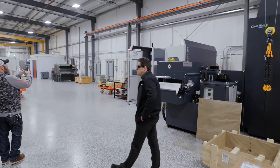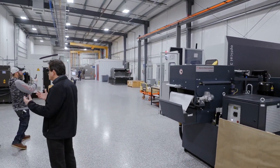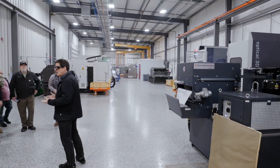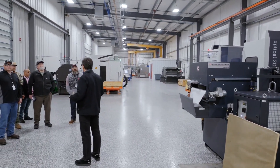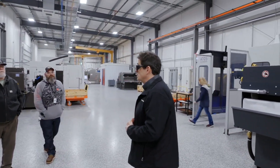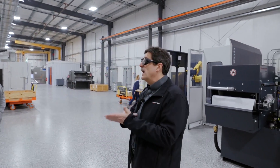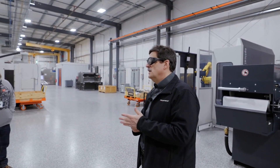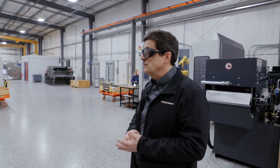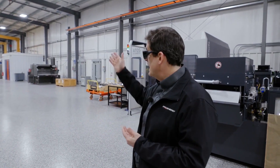Prenergy has made a huge investment in our expansion and our ability to make parts. Parts are obviously a constraint in any turbine overhaul shop, and you want to be able to make some of your own new parts. This area also handles repair machining — for example, the laser weld on the z-notch can be done in repair or new make, and the best way to finish machine that laser weld is with a creep feed grinder, which is back in the corner.